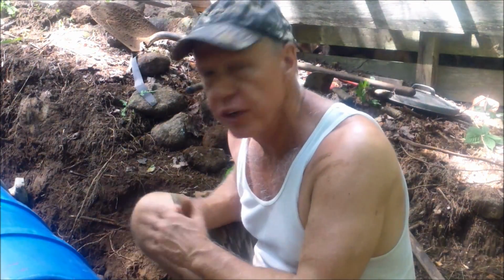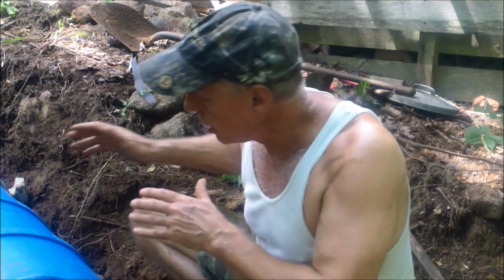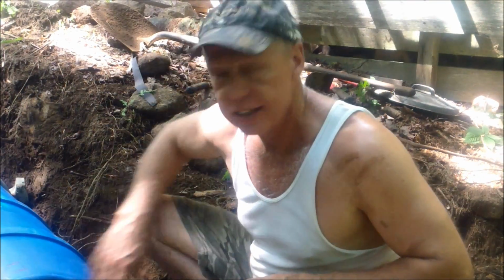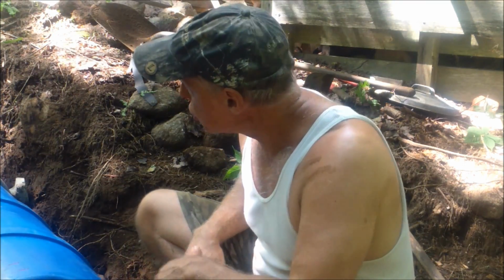In the future, if I ever have trouble with the leach field not draining properly, I don't have to dig any of this up. I can just start digging at the end of the second barrel. Anything that was backed up will drain on through. I'll add another length or 2 of barrel. It should last a good long time, if not the rest of my life.